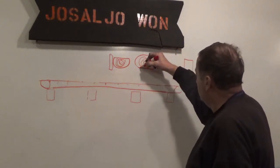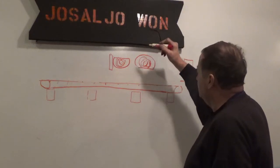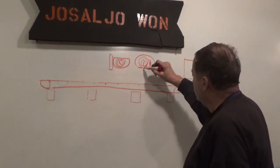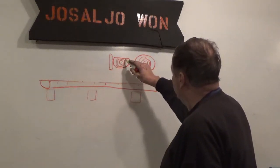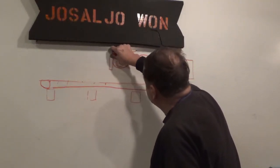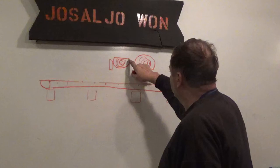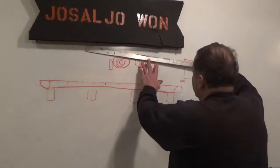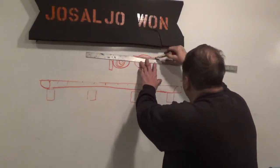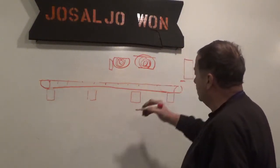When you put this cut down on the bunk and make another cut through here, the cut you make is parallel to the cut you just made, the previous cut. So in other words, when I take this log and roll it over, I made a cut here, right here. I rolled the log 180 degrees. When I make my next cut through this log, that is going to be parallel to this. So this log is equal distance all the way down it.